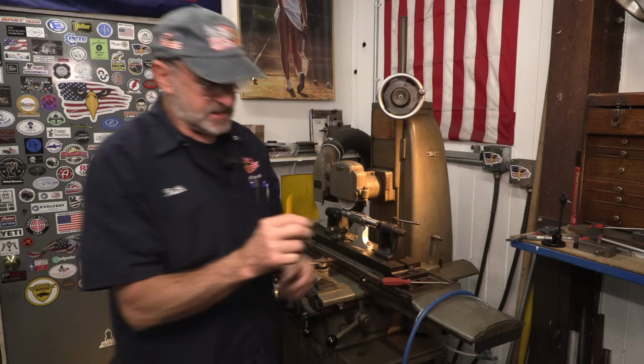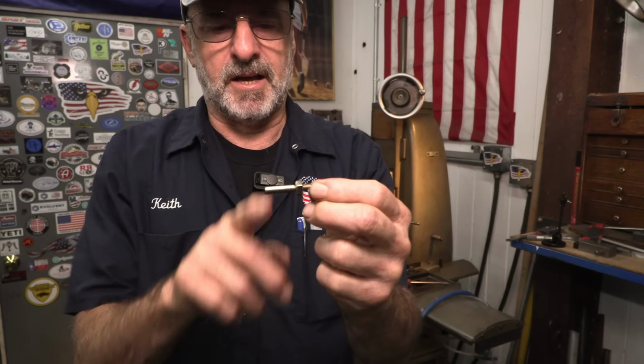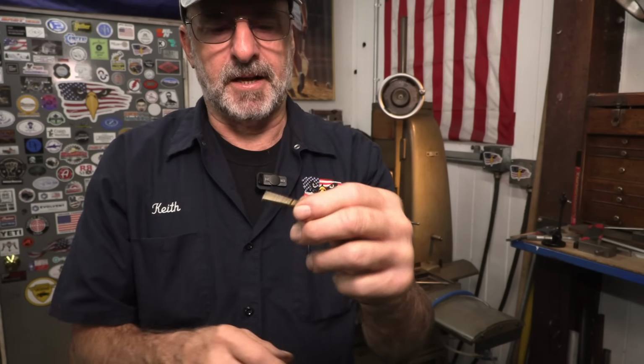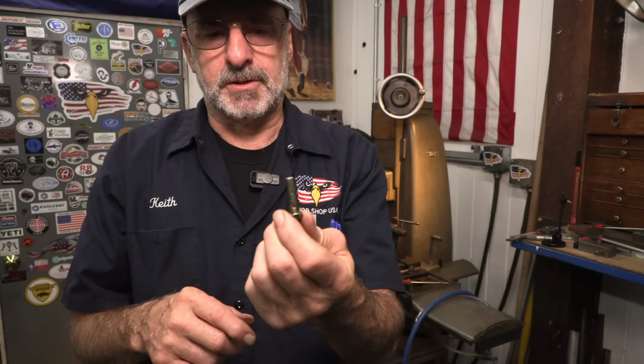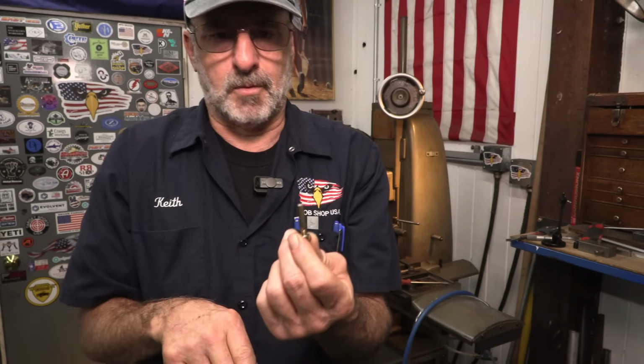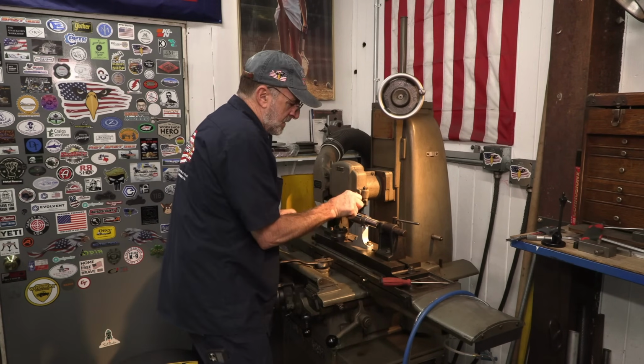With a lot of other attachments, I've had a couple of these, and I just take a quarter inch bolt and cut the head off, leave the shank and that thread, and then lock it on a nut. Sometimes this actually screws into some of my mag bases and I can use it for a short indicator support. Also, things like this.